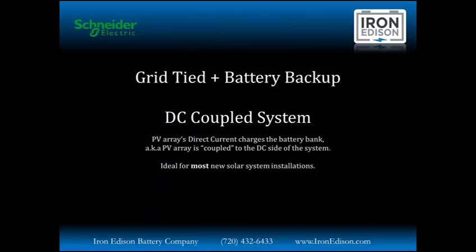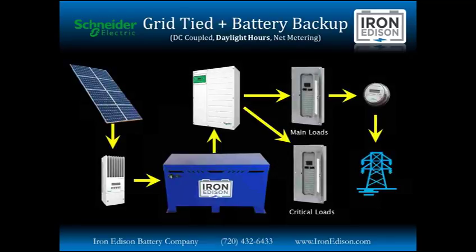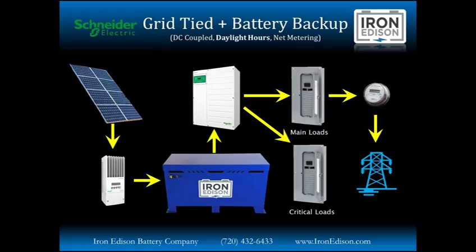The next type of system we're going to look at here is the grid tie with battery backup in a DC coupled system. The DC coupled system is the preferred method for any new solar system. In a DC coupled system, we have the PV array's direct current directly connected to the battery bank that's able to store that direct current. So in other words, the DC is coupled to the battery side of the system. This is the type of system that I operate at my house, DC coupled grid tie battery backup with net metering.